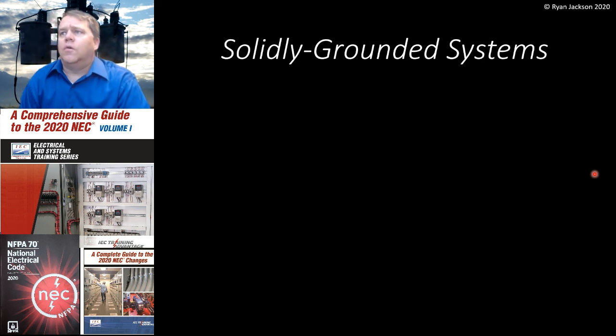So we can break down transformers into a couple of general concepts. We have solidly grounded systems, and that's what most of us use. In fact, I would say that most electricians will actually never use anything but a solidly grounded system. We will talk about ungrounded systems and high impedance grounded systems, and then we'll also talk about some of the other oddities, zigzag grounding transformers, autotransformers, and things like that.